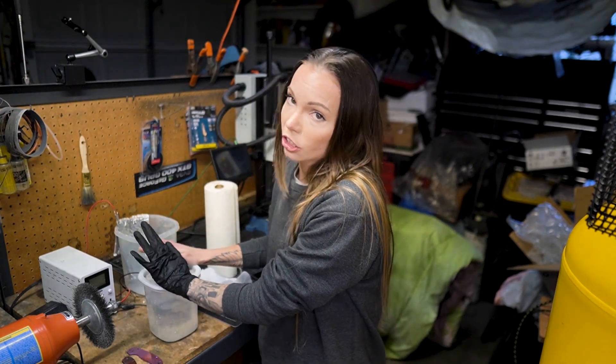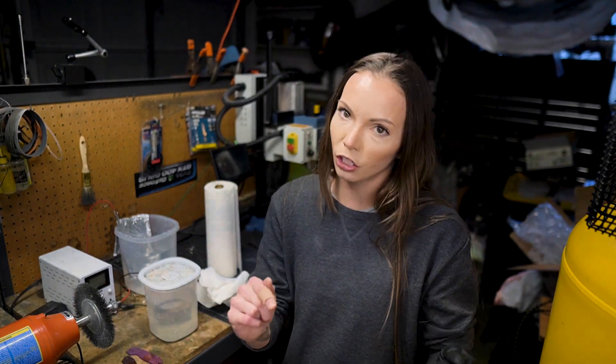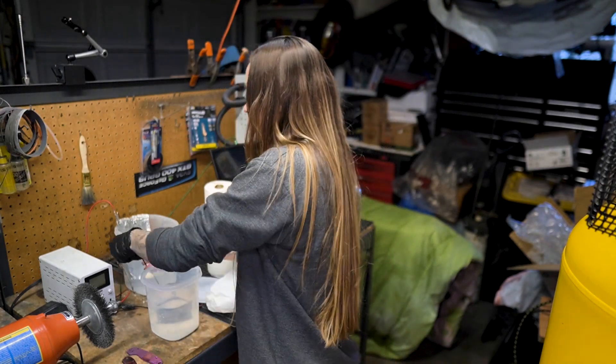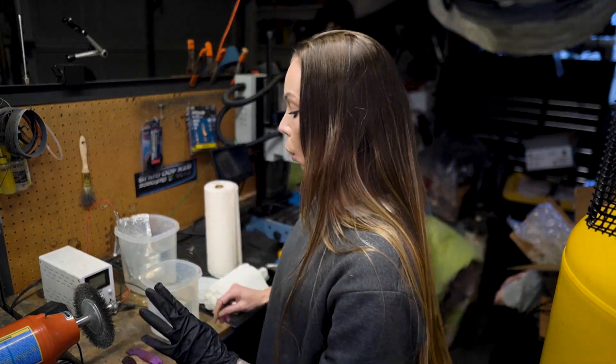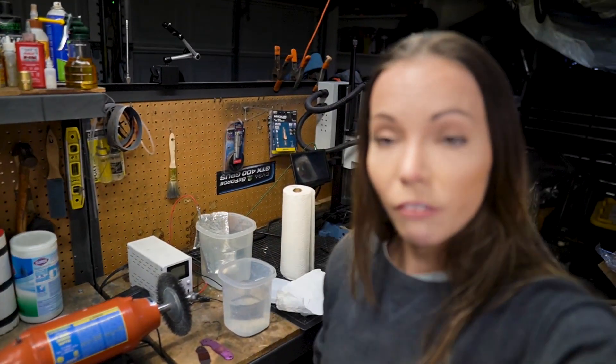Let's talk about what if you mess this up — what if something happens, it wasn't completely clean, or maybe you just want to strip it because you want to anodize it a different color. You're going to need Wink Rust and Stain Remover or Multi-Etch, either or — I'll link it below, it's available on Amazon. You submerge your piece into the etchant and let it sit until the anno is completely gone. Or if you have access to a buffing wheel you can buff it off, a belt sander you can grind it off, or a compressor and blast cabinet you can bead blast or glass blast it off.